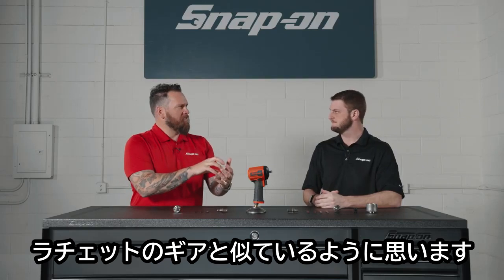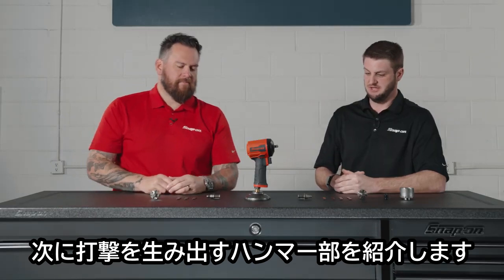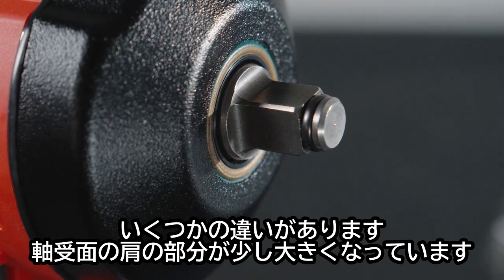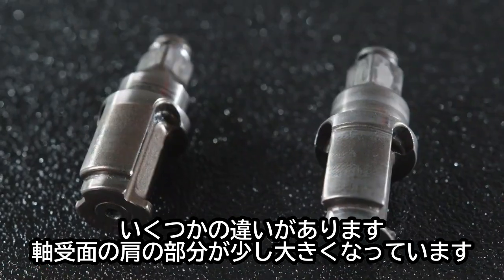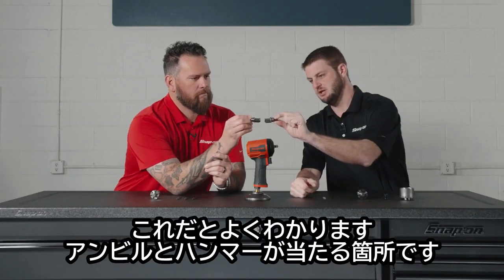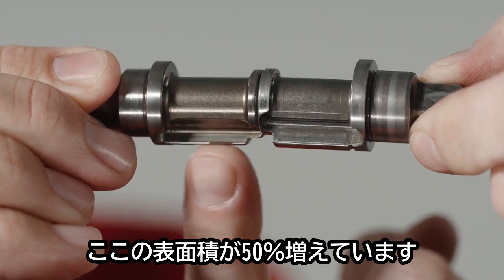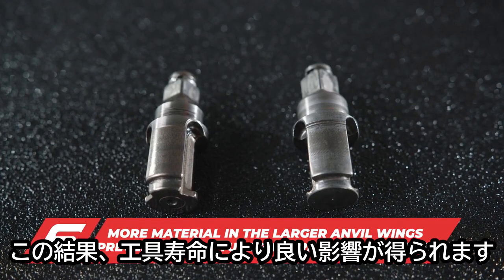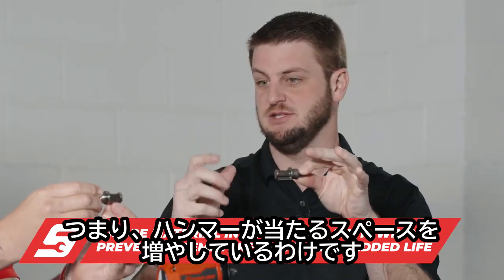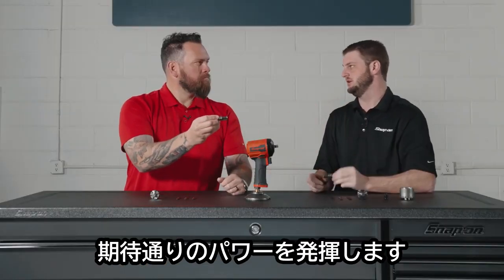It's like teeth on a ratchet — those fine tooth ratchets that are always ready to strike. Moving to the working end of the tool, this is the anvil. We have a larger shoulder where the bearing surface sits, giving the tool a little bit longer life. But where you really notice the difference is where the anvil and hammer meet — there's 50% more surface area right there. That gives you better tool life, more space for those hammers to hit, less wear, and it'll deliver the power level you expect for longer.